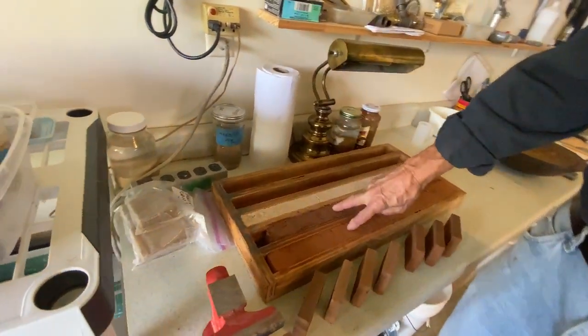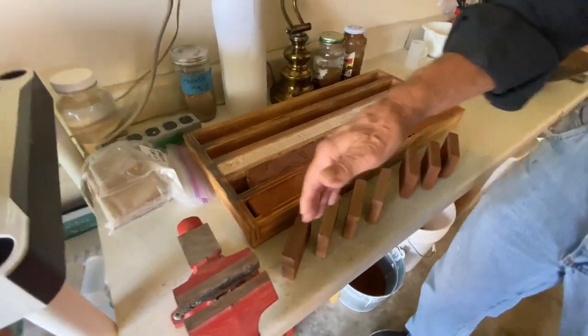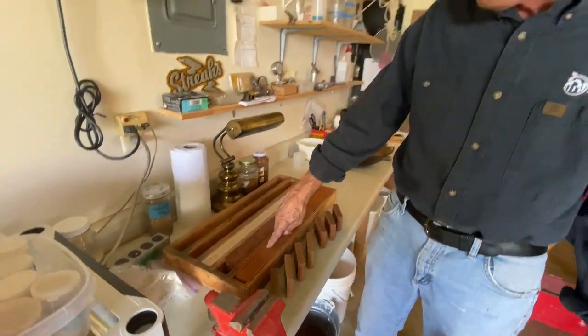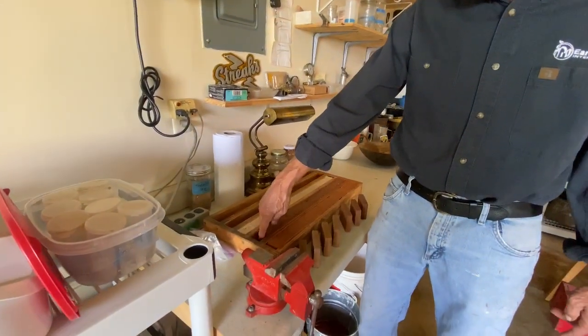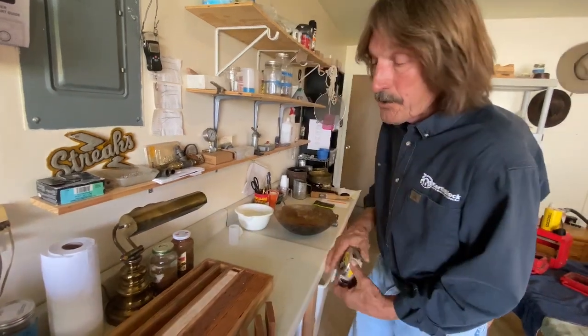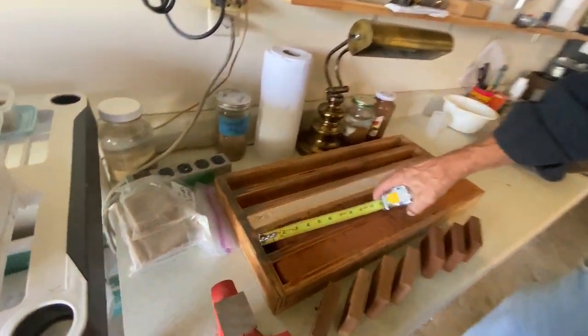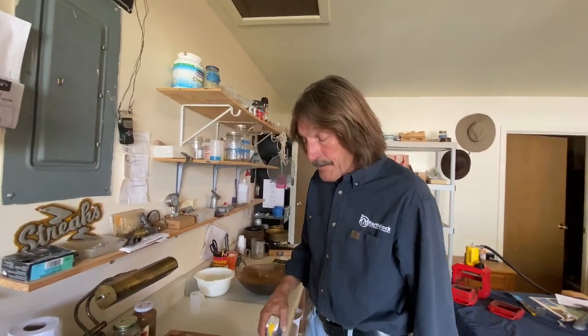These two samples right here are the two soils that we're mixing for these blocks. This is the sandier soil — very low clay content. This is a very high clay content, and you can see the difference right here. This shrunk more than an inch, and what that tells you is there's too much clay. You need a sandier mix. So we're mixing this sandy soil with it and getting these various mixtures.